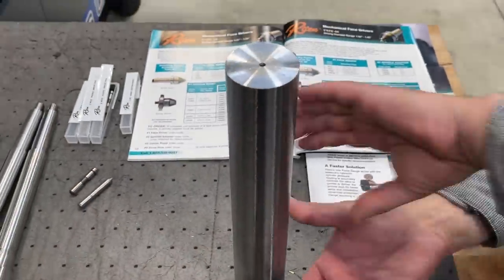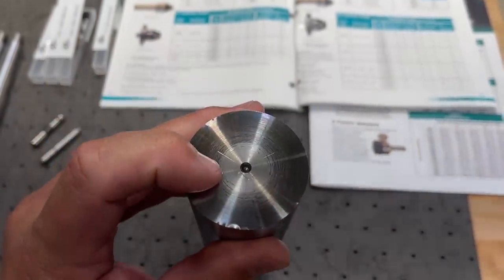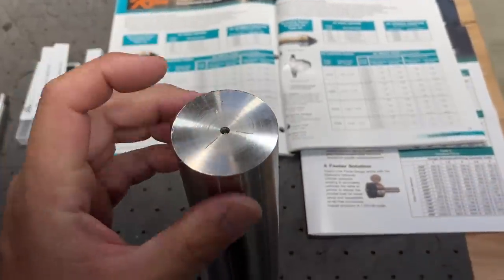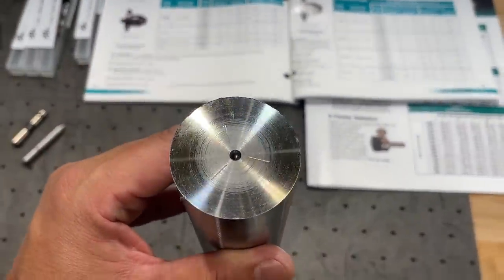All right, and if we flip it over, this is the side that we applied the pressure to without taking the cut, and you can see it's not fully seated. So it's just an important step to make whenever you set your workpiece up, that you always make that first cut against the face driver to get it seated properly, okay?